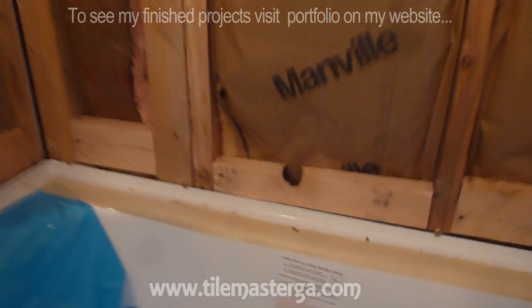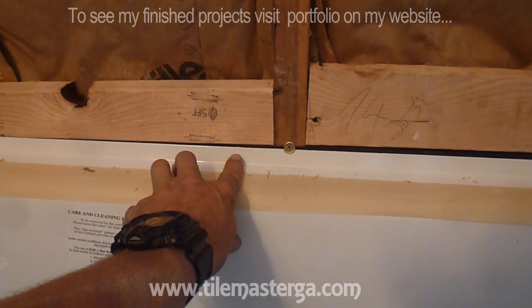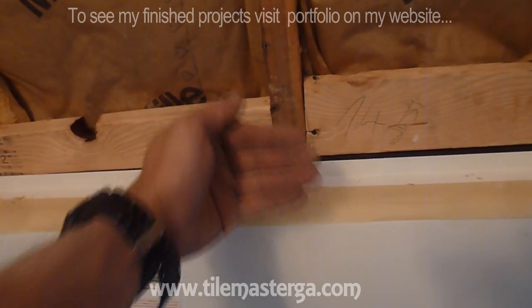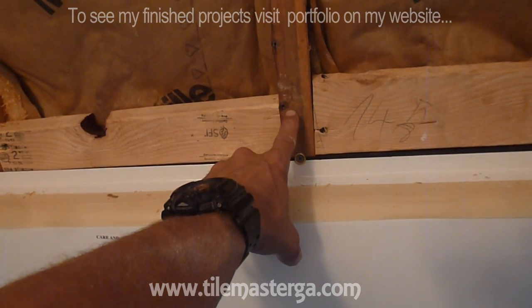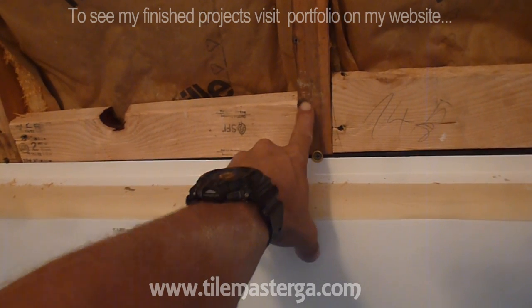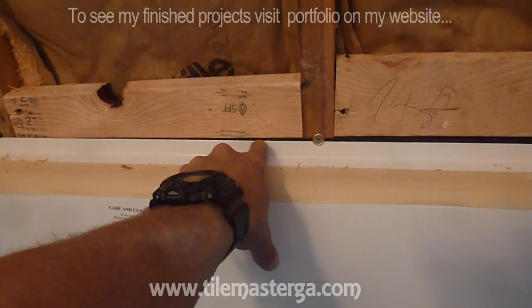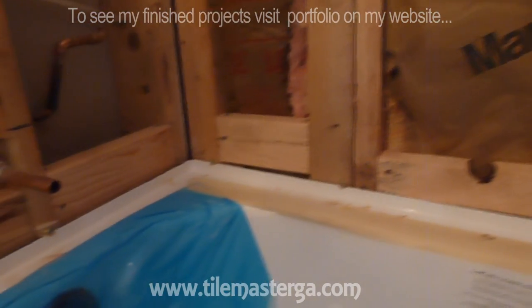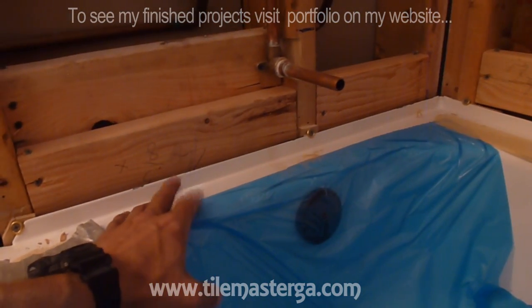The way we will be installing it, the way I'm doing it, I'm always running board to the lip. I'm never really overlapping the board, simply because the lip is not always even, and we don't want the board to be bent or a gap to appear here between the board and the stud. So I'm always running as close as I can to the lip of the tub over here, and the transition I will fill with 100% silicone to seal it nicely.